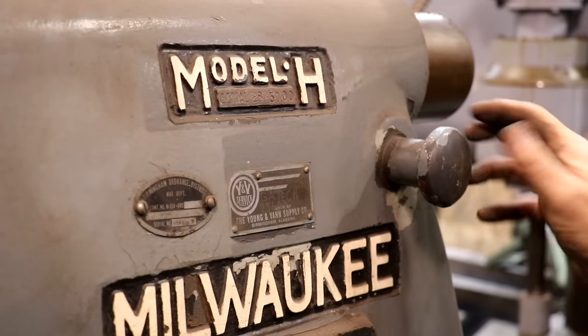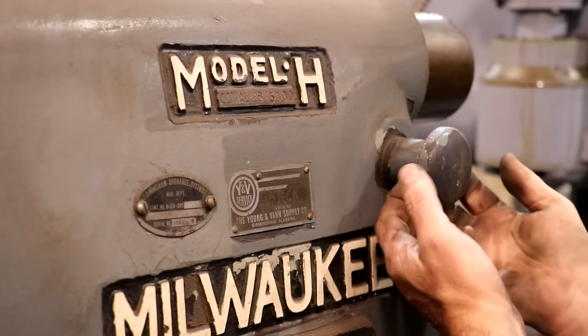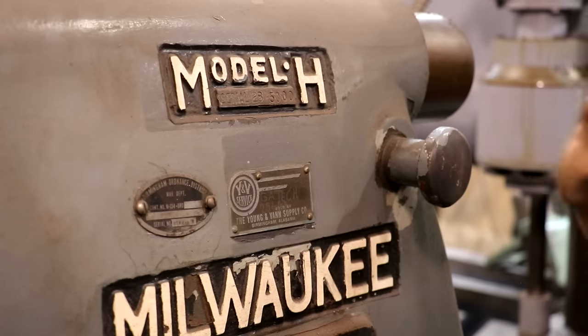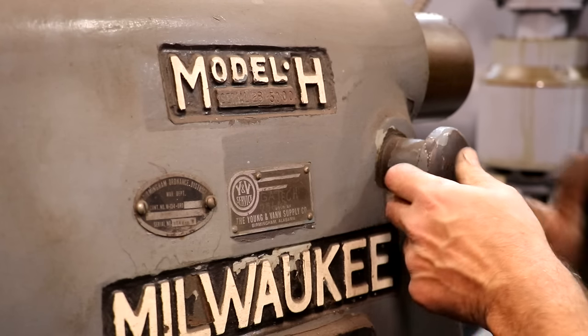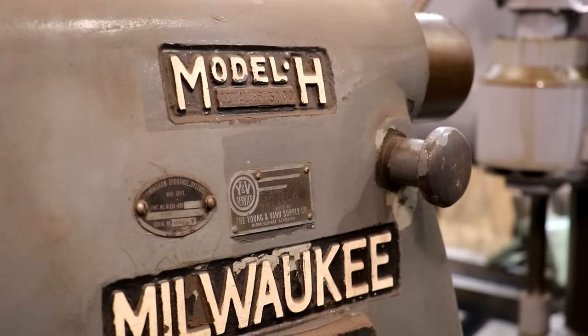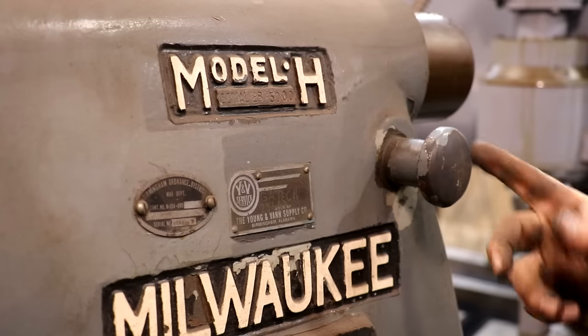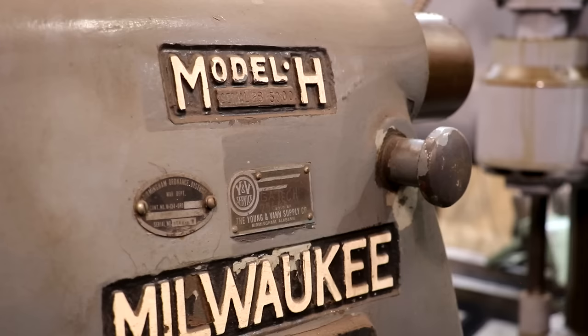This is the culprit that we were talking about. I don't know why it needs this outside flange on here — this serves no purpose at all. It's just kind of a cap that holds that rod in there. I think there is a pin that holds that in place, but why it needs that outside flange, I don't know, and nobody that I've talked to knows. So we're probably just going to have to grind that off to make it fit. I don't like doing that, but I just don't know what else to do.